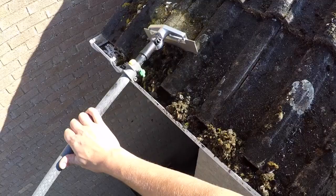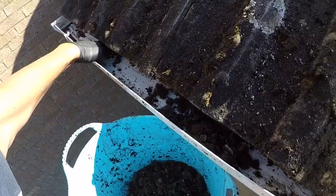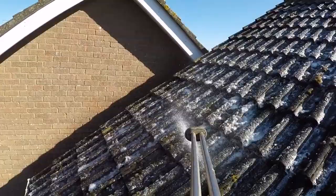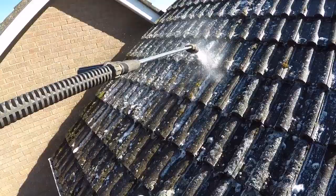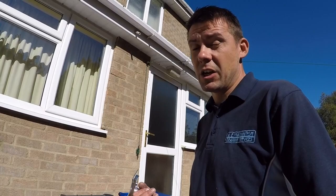As you can probably see, the Marshall Pro Scraper isn't going to remove every fragment of moss on the roof, but really we're using it to remove the worst of the moss — the big clumps — and then it really complements the biocide well because the biocide kills off anything that's left behind. So it's a really great combination to use both techniques together to help maintain the roof.